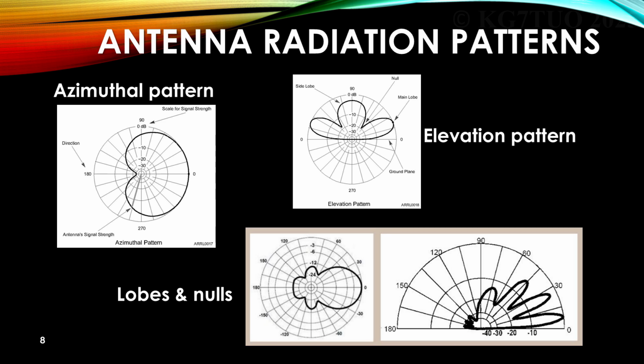I've got like a 7-element antenna that's on a rotator. When I point it north, I've got a bigger signal. I can go all the way up to Roseburg on 2 meters. Turning it around doesn't really do much. The pass is too high. You'd have too much of an angle to get over, and I can't hear California.